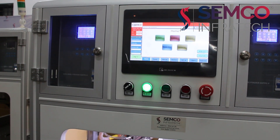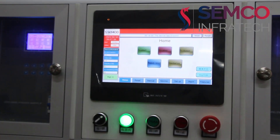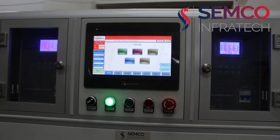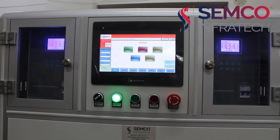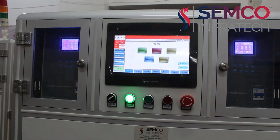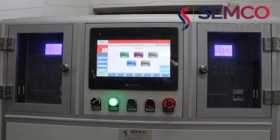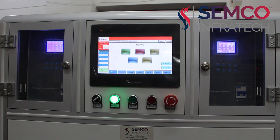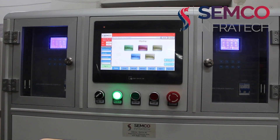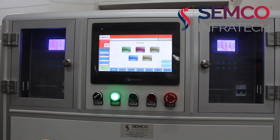This 6-axis double-sided spot welding machine is required for spot welding at both sides of the cells or for making a battery pack. This device requires 2.5 kW input supply, single-phase 220V plus-minus 10%, 50Hz power supply, and also a pneumatic pressure of nearly 0.5 MPa.